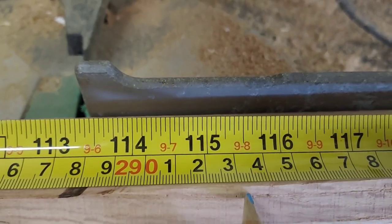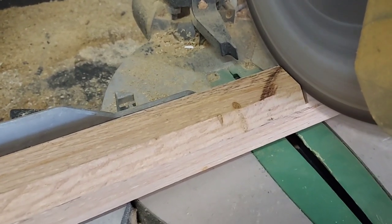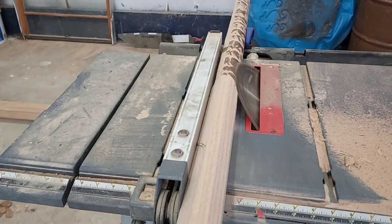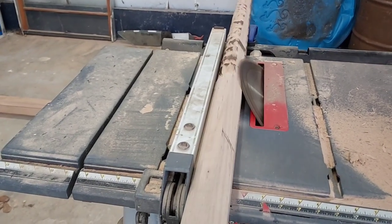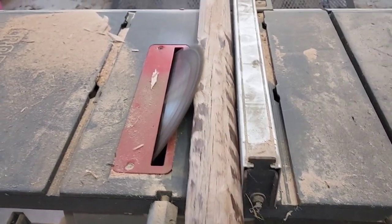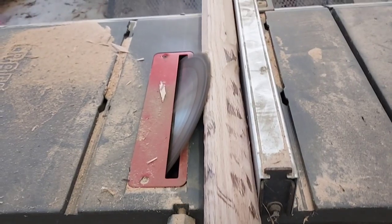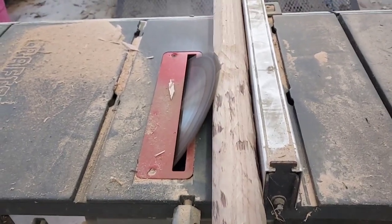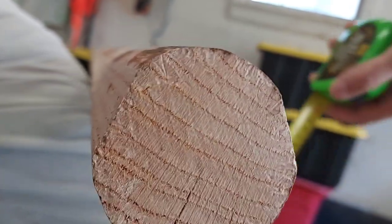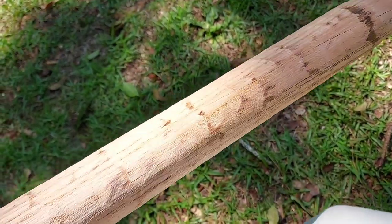There's some measurements there. I was going for a nine foot eight inch length and an inch and seven-eighths diameter. This was the coolest part a friend showed me: you can tilt the blade of a table saw, and if you rotate the oar — you have to set that runner to the right spot for what you want — but if you rotate the oar as you work it through, you can actually round off those hexagon shapes, and you end up with something that kind of almost looks like it's been lathed. It's a neat table saw trick I never knew.